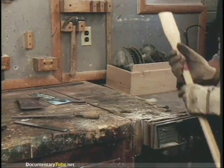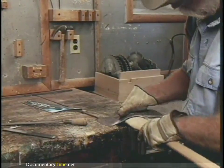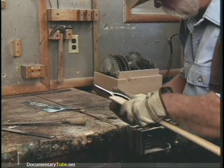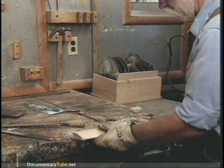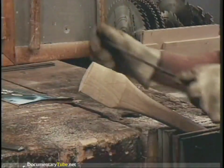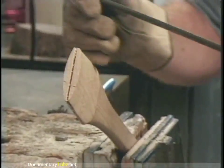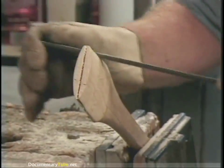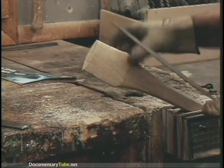Let's look at it for fit to start off with here, see where we are with it. It's a little bit too fat, a little bit too long — I'm going to have to take some off the sides here and some in here. Let's start with the edges. A rasp you can use in a back-and-forth motion, although it tends to clog it up, unlike a file which should never be used in a back-and-forth motion — only pushed away from you. When it clogs up, take a wire brush and clean it out. I'm going to work both sides down and then the cheeks as well.